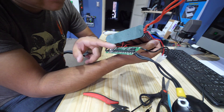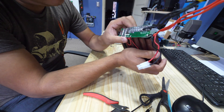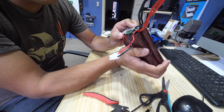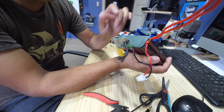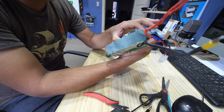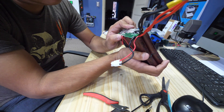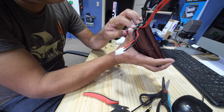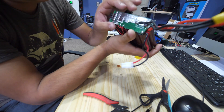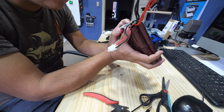A lot of MOSFETs here, all in parallel — so that means this thing could probably handle quite a bit of amps. 3S 12P. So there you go, it's only 8P. This one only has 8P, and the PCB says it could do 12P, so maybe it can handle more.